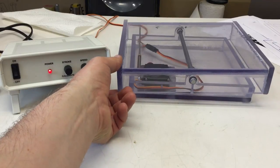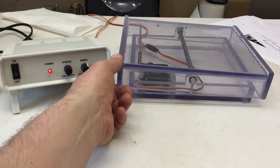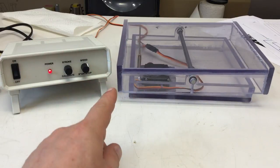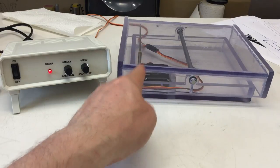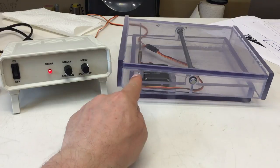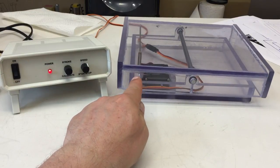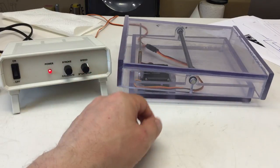I'm trying to determine. Yeah, it's probably the pin. Yeah, I can feel it. The pin has a little bit much give, but that can be remedied. I actually have enough meat there to replace the threaded rod, M3 threaded rod, by an M4 or 4mm rod, just with M4 threads at the end, if the need should arise.